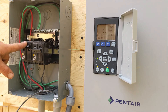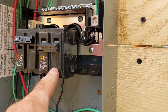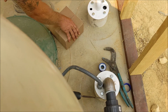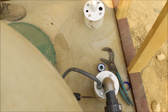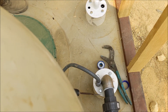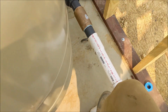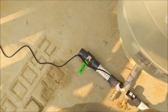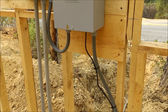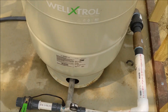This left-hand breaker is the booster pump and the right-hand breaker is the well pump. If there's a broken line or the booster pump in the tank runs for more than 24 hours, it turns itself off. If it can't maintain a certain PSI — usually if it falls below 10 PSI — it'll shut itself off also. Is it possible to burn up the booster pump? No, because if it runs out of water it's going to shut itself off. It pumps up through this two inch pipe into the pressure tank, and that pressure tank always has water.